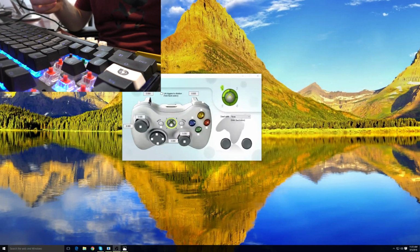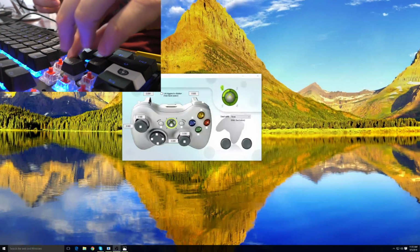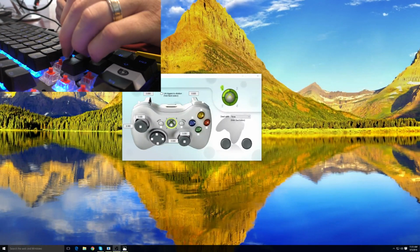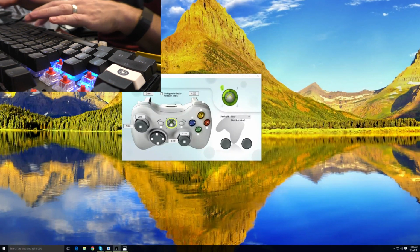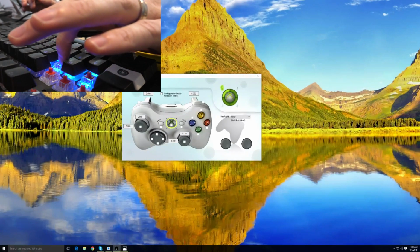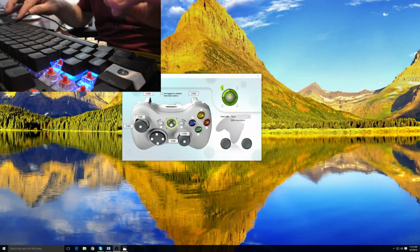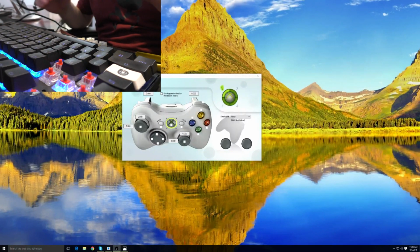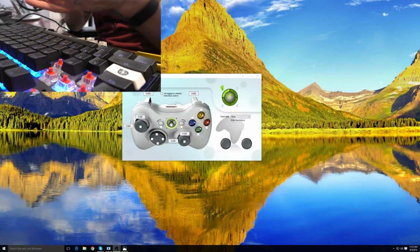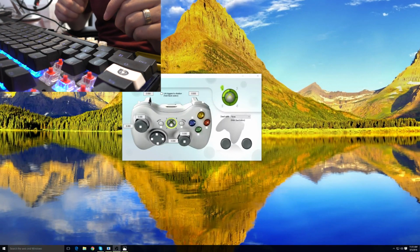So I'm going to stick these keycaps on here real quick and show you what that calibration process looks like, since I haven't really demonstrated that before either. I basically do this FN and scroll lock, and now what it's doing is looking at the very top of the key press and at the very bottom of the key press and writing values to the firmware saying this is the absolute highest value I'm reading and this is the absolute lowest value I'm reading. So this is the range of values that you can use for this switch.